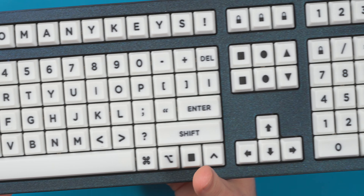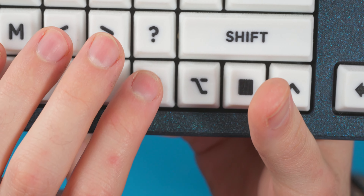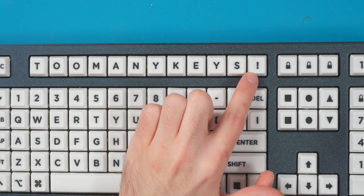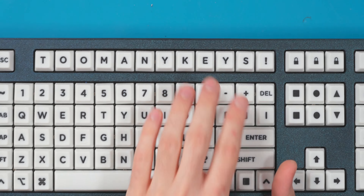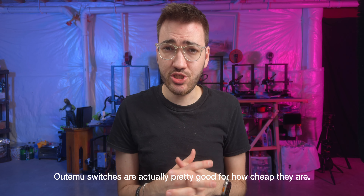All the keycaps are on the board and they look really nice. If you look closely you can see they're dual-color printed, but they're pretty smooth because they're printed at 0.12mm layer height. Up top we have the 'too many keys' label — I don't like 100% boards, and if I did F1 through F12 the legends would get too small to print reliably, so the 'too many keys' joke works out. These sound pretty decent for cheap switches, so let's do a typing test.